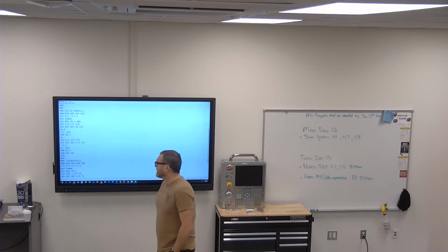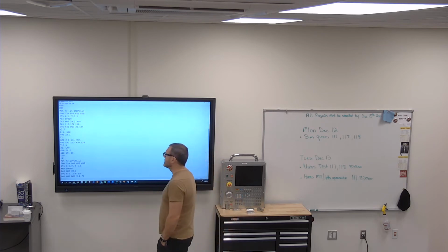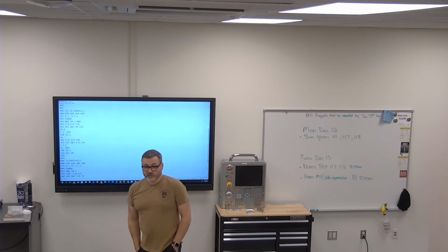So on that line, you have a G1 move, right? G1 and G41 are both movements, right? Well, G1 is a feed move. G41 is cutter compensation on to the left. So that's how you know that this program is using cutter comp. You'll see G41 and D3 used on the same line. The D is just your tool number. It doesn't have anything to do with size.